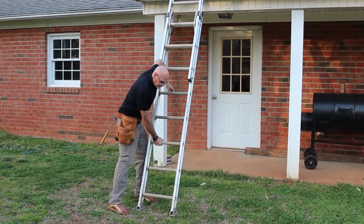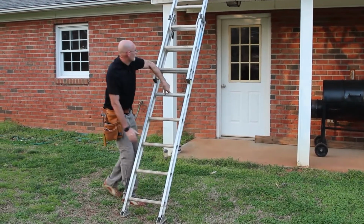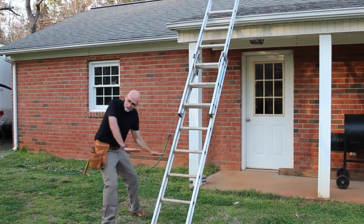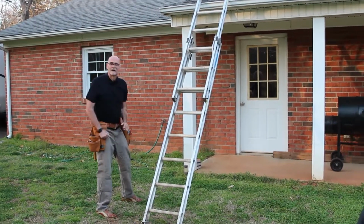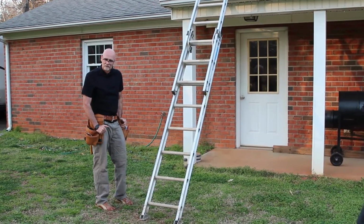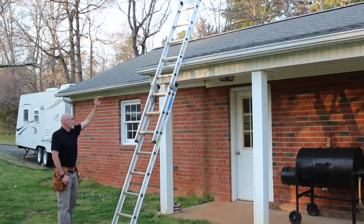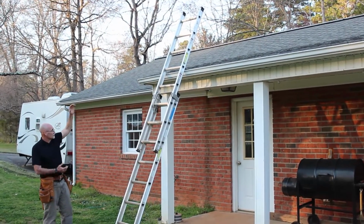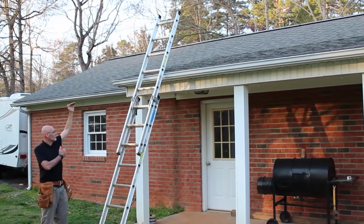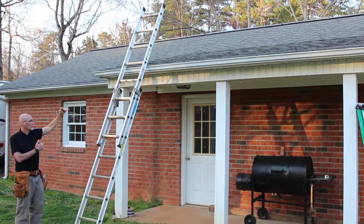In other words, I'll give you an example. I don't want it like this, okay? Chance of it sliding out, and the next thing you're doing, you're riding that ladder down. Depending on how high you are, you could have a serious injury. All right, so the other things we want to look at, guys, at the top, where you see the ladder, it should always be a minimum of 3 foot above the platform area that you're getting off, the flat part of the platform.